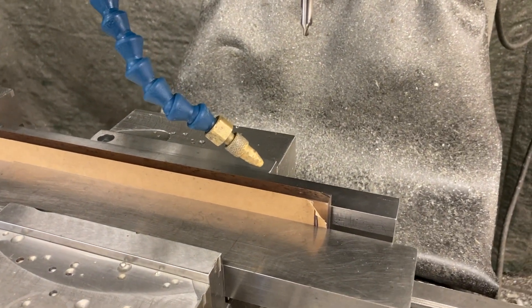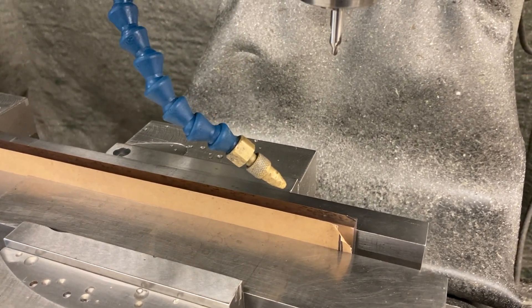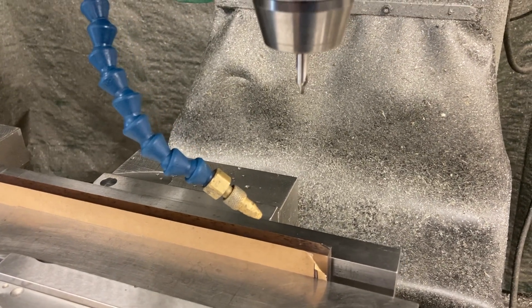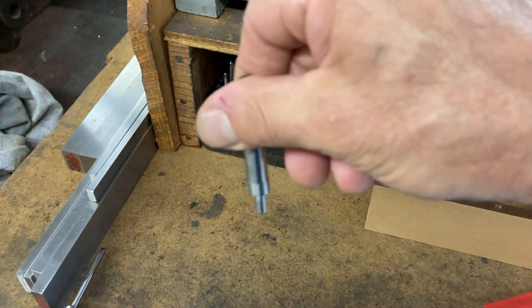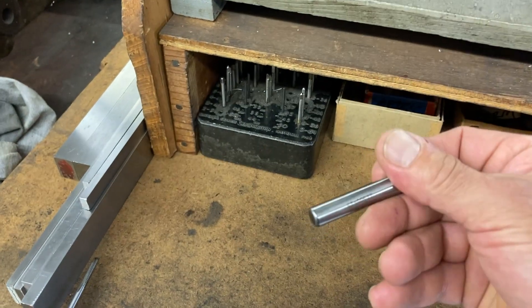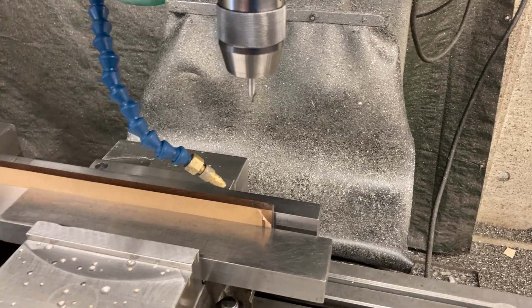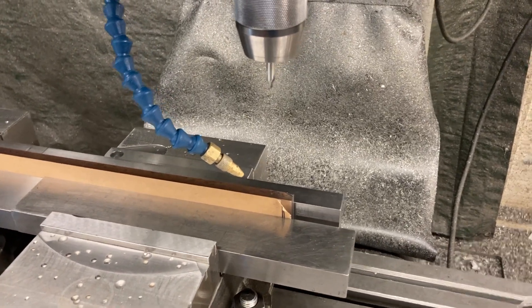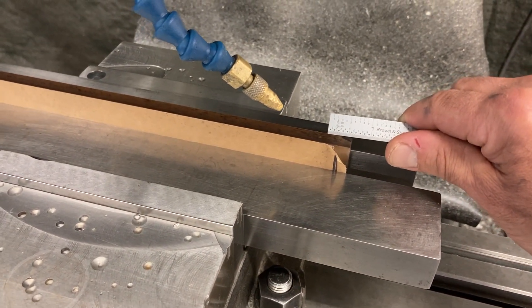Scale or whale? What I mean is, if you don't scale out that first hole and it's not in the right position, all the rest of them are going to be in the wrong position too. The most likely situation is you forget to account for half of your edge finder. That one's 200 thousandths diameter, so I go 100 thousandths. But if you got one that's 500, you go 250. So most of the time that's where you're going to screw up — you touch off, zero out, forget about the edge finder, and all your holes are 100 thousandths off. Scale out that first one, or you're going to be wailing later when you realize they're 100 or 250 thousandths out of position.